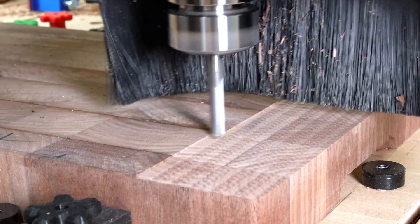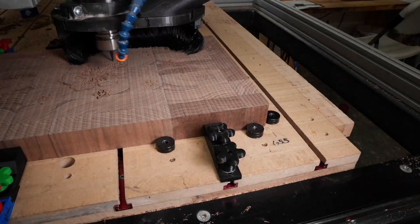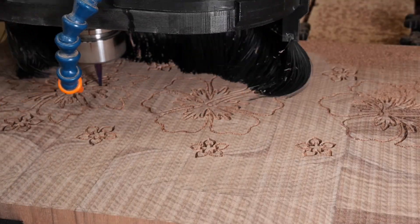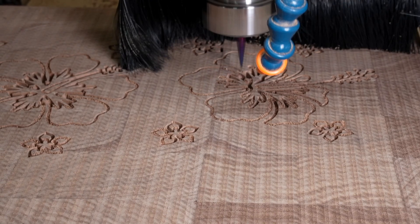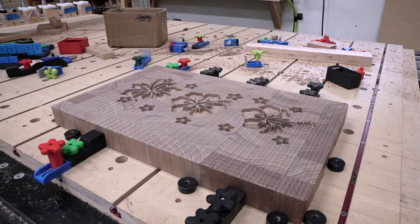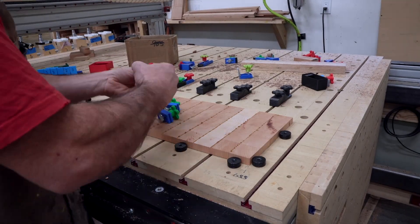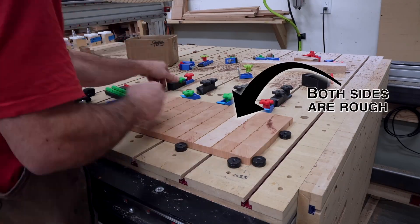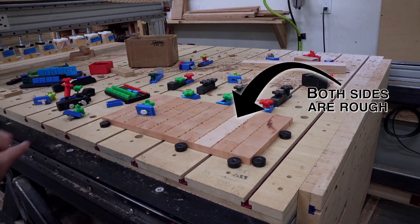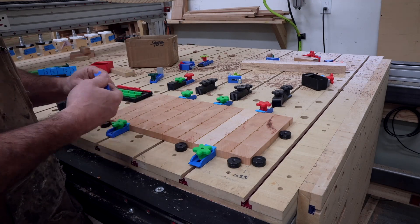The plug-in works pretty well to generate inlays for vectors that are pretty clean — meaning the vectors don't have any zero-length spans, they aren't overlapping or touching, and in other words they're designed for doing a VCarve inlay. I haven't done a lot of cutting boards, and I'm really working out my process on what works best for me and what makes the most consistent results with the least amount of work.